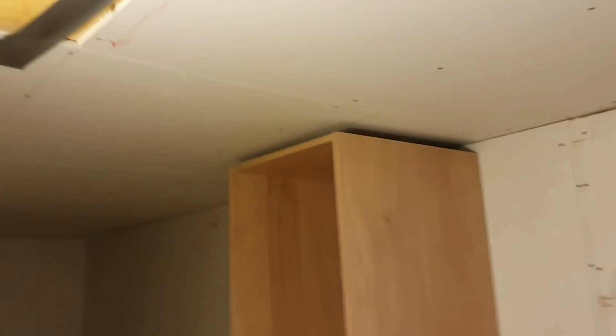I know I've got a noggin up here so I may create a little channel in the back to fix it back, and then screw it into the wall. At the top there's a 35 mil gap and that's going to take the filler section - there's just enough room for the top to go in flush. If the ceiling's any good it'll work. And it's Friday night so I'm having a little drink.